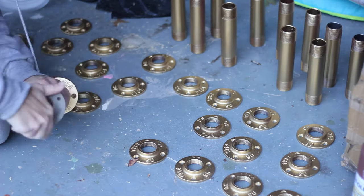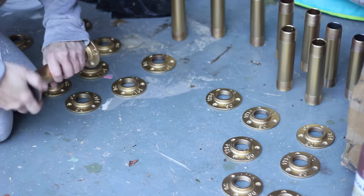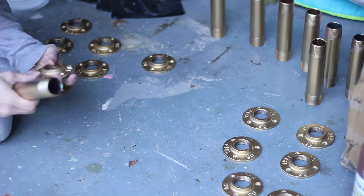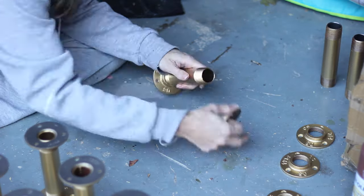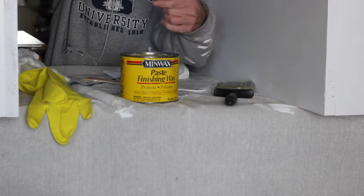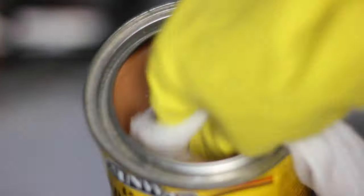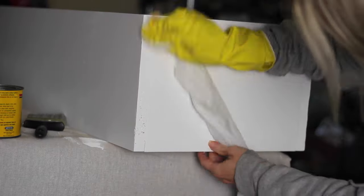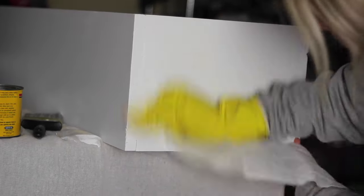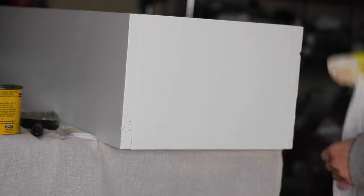After my spray paint had dried I went ahead and screwed the pipe pieces into the flanges. After the second coat of paint had dried on my shelves, I sealed it with furniture paste wax in a natural shade — I'll link to this below. I like to apply it with cheesecloth, coating it and then applying it through a folded layer. I apply it as evenly as possible, let it sit for 20 minutes, then go back in and buff it with a clean cotton cloth — an old t-shirt works great for this.